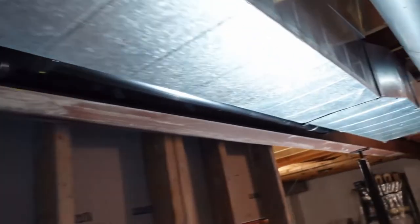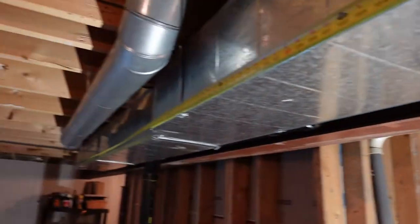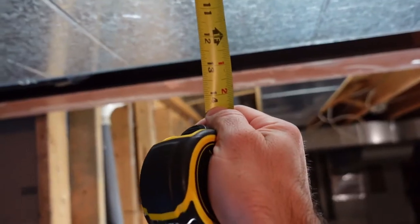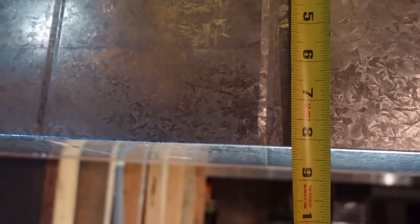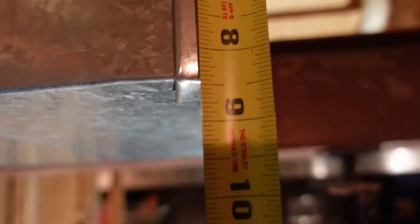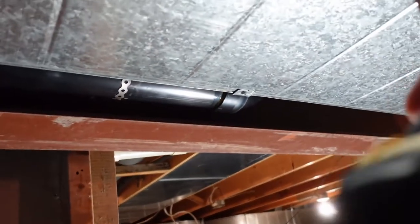This chunk of cold air return is about 12 feet. I just got a bunch of eight-foot two-by-fours and I'll do it in two pieces, joining the ends on a floor joist. The big thing you need to know is the lowest point your framing will have to clear underneath the ductwork — for me that's eight and a half inches. I checked it in a few different spots to confirm. Because the ceiling is fairly low in this house, I want to frame everything really tight to the ducts so there's no risk of hitting your head.